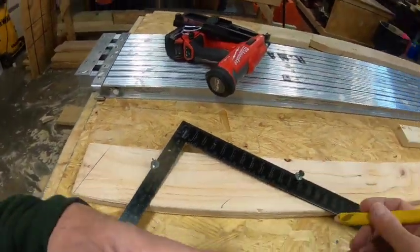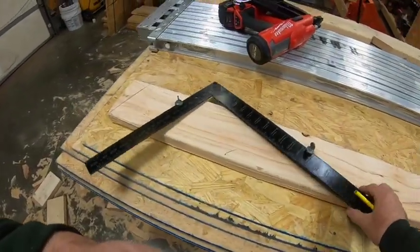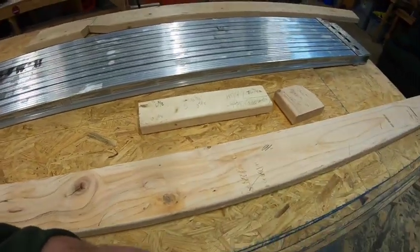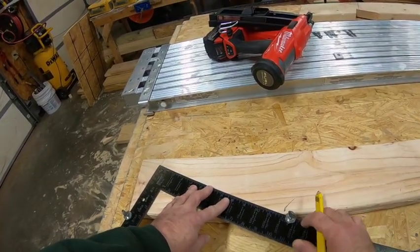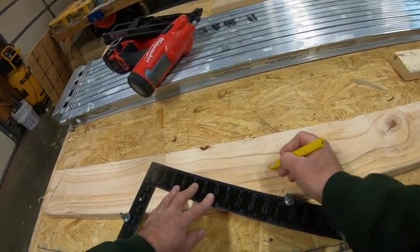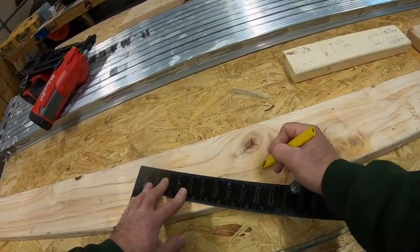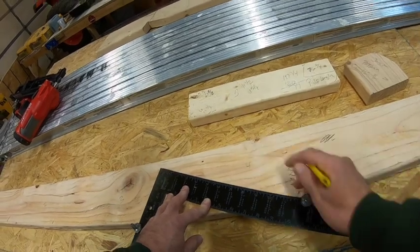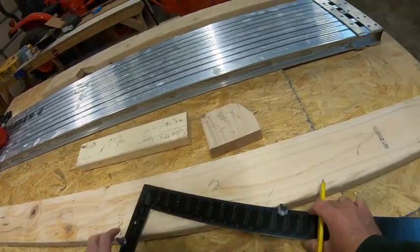I'm going to step this off because it's an odd-numbered width. The easiest and quickest way math-wise to get an exact rafter is to step it off. I know that 67 and 5/8 — 5 foot is 60 inches and then I've got to add 7 and 5/8, plus a 12-inch overhang. So I mark 12 here — that's one foot. Come over, line up on the edge, mark 12 — that's two foot. Same thing again — mark 12, that's three foot. I'm making a pattern that will cut all the rafters. Mark 12 again — that's four foot. One more time — that's five foot, so I'm at my 60 inches.